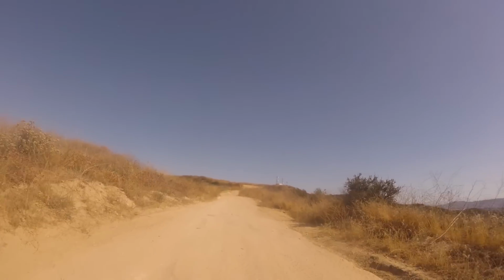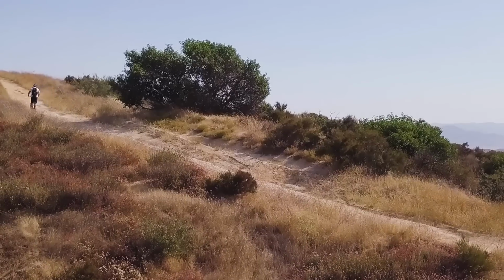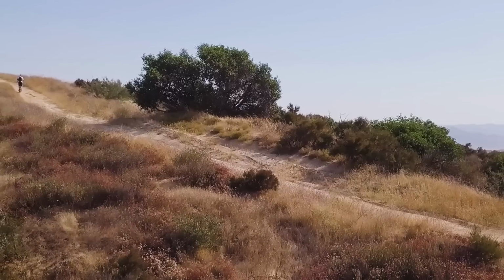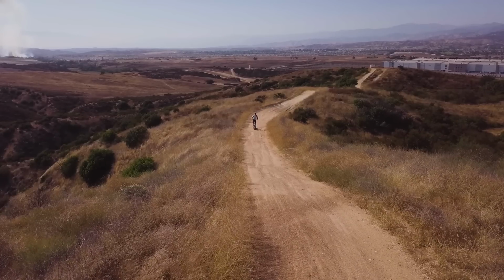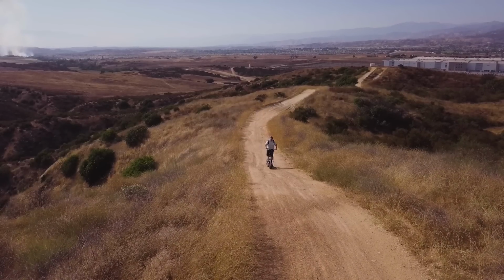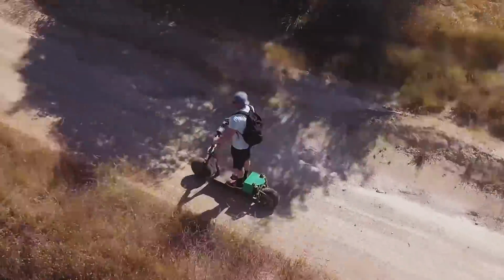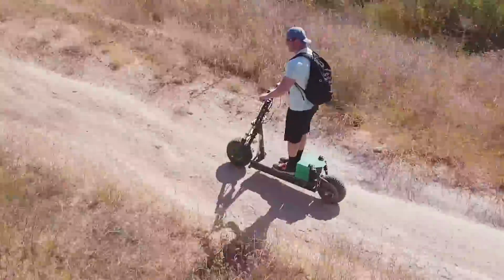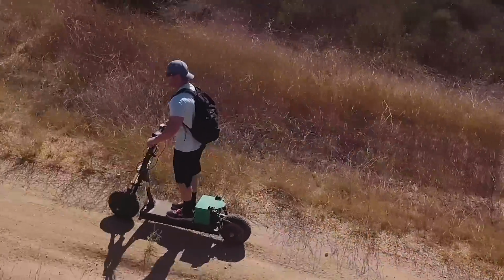Now really it comes to traction. So the traction part is really up to the wheel diameter and the weight and a lot of different parameters, but in this case we're working with 14 inches, and what I learned is to lower the pressure of the tire a little bit, the back one, and that helps me get some more traction to the wheel, because it has so much torque that it will spin out the tire a lot. It's just basically a go-kart. You gotta look at it if you look at it right here.